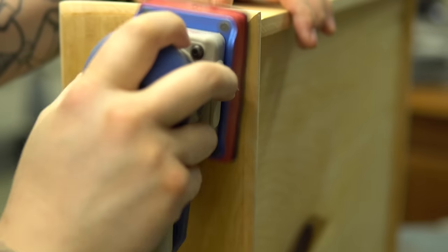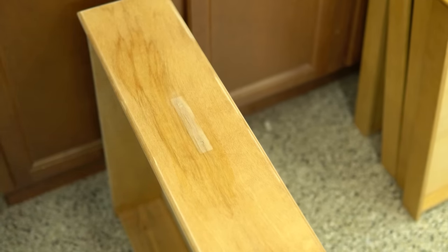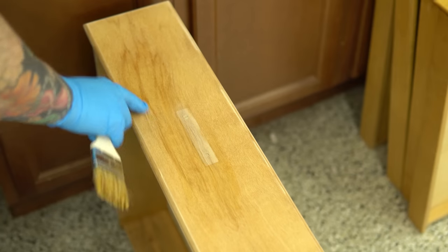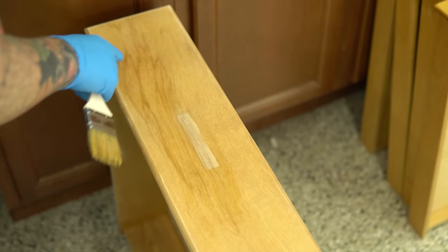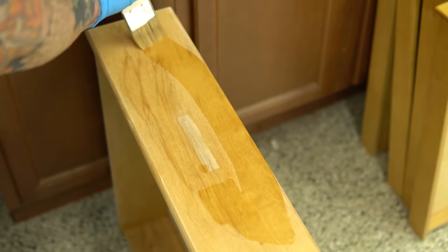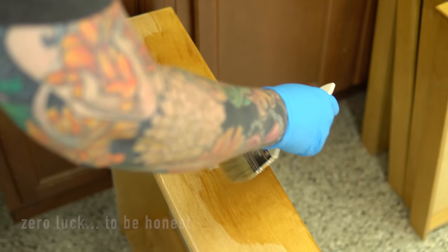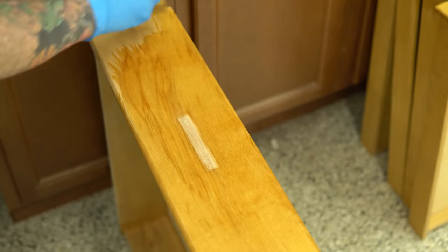All of the drawers were cleaned out, but there's some residual staining and just years and years of aging. I love using my Surf Prep sander for pieces like this because of the shape — you can get right into the corners. Because these are solid wood drawers, I initially tried to sand through the old finish; it was a bit thick but I got through it. There are a couple of ways to take care of ghosting from handles — it's caused by oxidation and UV light exposure changing the color of the exposed wood. I haven't had a lot of luck using oxalic acid on light-colored woods, but I have had really good luck on dark woods. I decided to try it anyway — heads up, it didn't make much difference, but it did take care of the stain inside the drawer.